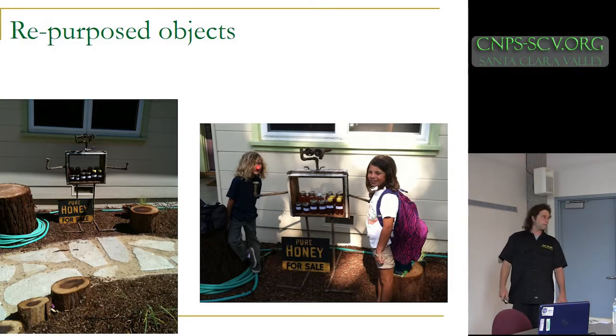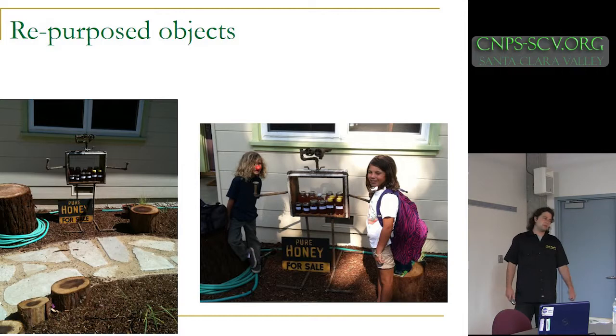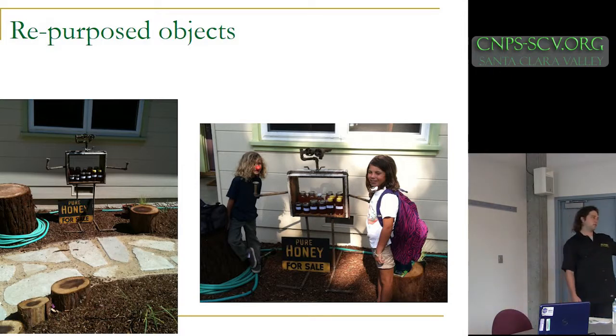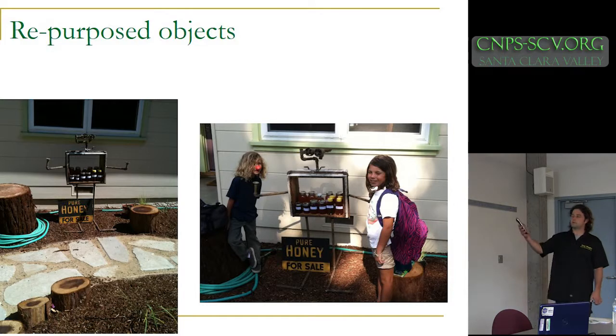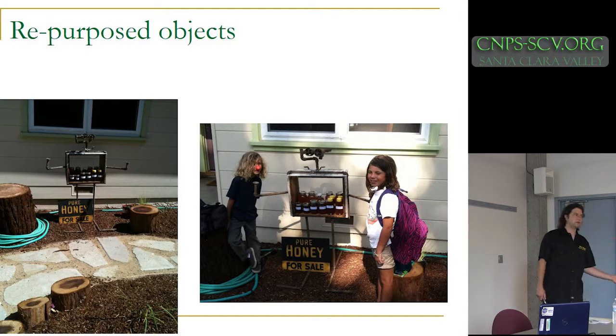Do you have a layer under the granite of anything? Is there sand or anything under that? You can do base rock. Because the sand and DG are such similar drainage consistency, you might as well do all the DG. They're almost the same price. DG is a little bit more expensive. The DG we use has a binding agent in it, too, so it compacts down a little better. And that way you don't always have sand making a big mess everywhere. The one with the glue in it is a little more expensive as well. Or you can add the glue later on, whichever you prefer.